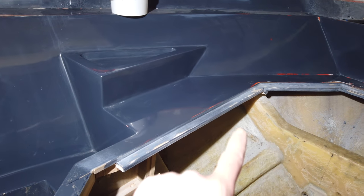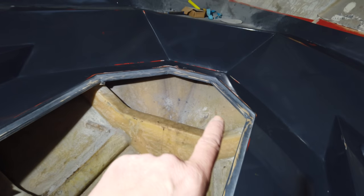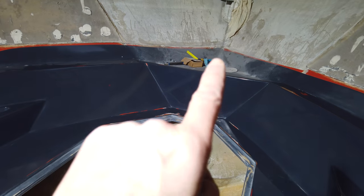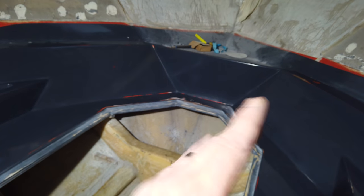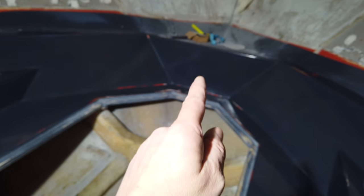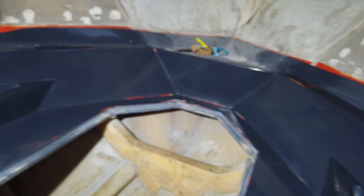We've just got to do a little bit of fine tuning on this edge, which we'll do tomorrow now. So we'll just finish that off by hand. And then we've also got to put a piece of wood here to basically split off the mould. So we'll probably hot glue gun that on. We'll put one piece on just to one side to create a centre line. And then we'll be able to